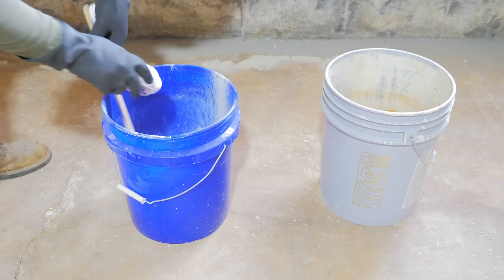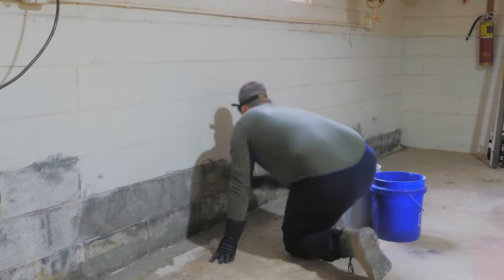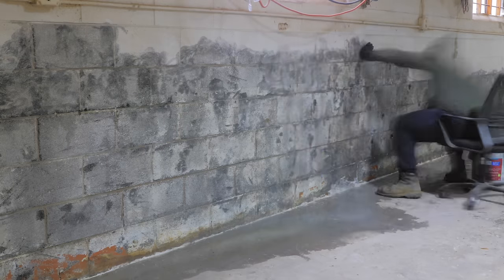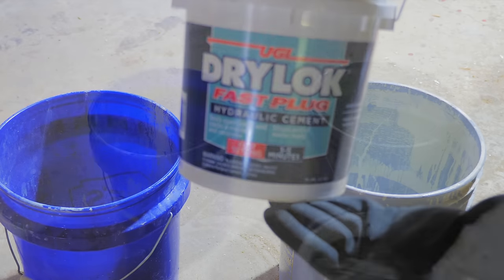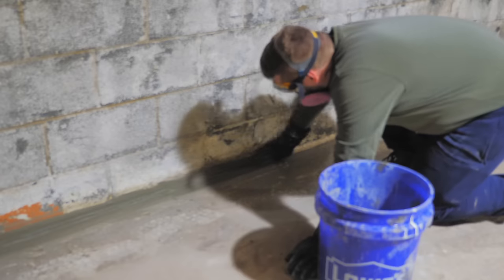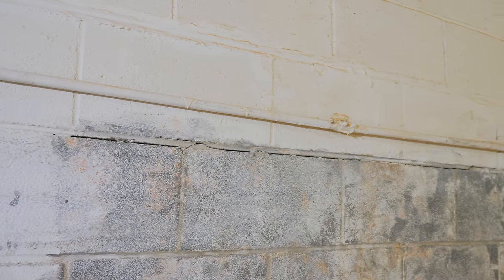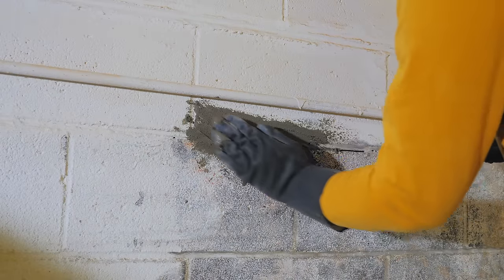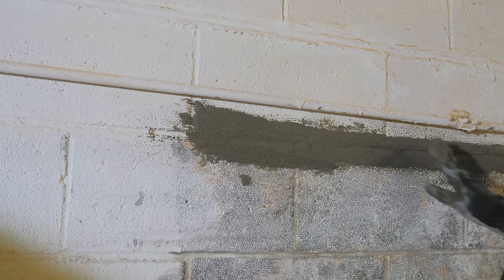Once satisfied with the paint removal, we started waterproofing by applying a concrete etch and cleaner with a stiff brush, then rinsing with water to neutralize the acid. Once etched, we patched problem areas with hydraulic cement — filling the joint where concrete block met the slab, which is where a lot of water was working through, and also filling big cracks in the block. Nate went through the entire ten-pound bucket of hydraulic cement fixing the block, and once that was done he could finally get the Drylock applied.